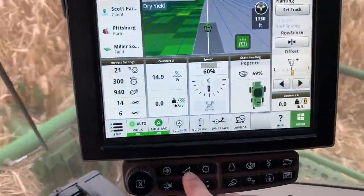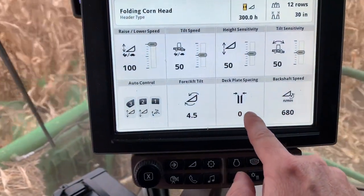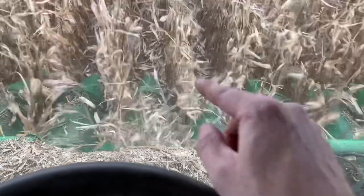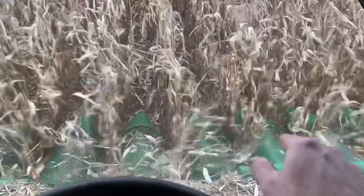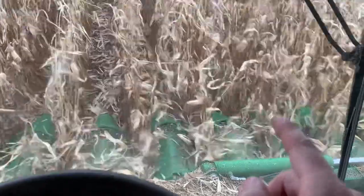The other main thing is the deck plates on the corn head. I have those set to zero — that's their tightest setting, not all the way closed. Where the corn's going down each row, there are metal plates; one side is hydraulically adjustable, sliding in and out towards each other — that's where the stalk goes through. In regular corn, you open those up as wide as your stalk, so the ear comes down and pops off on the deck plates, and most of the plant goes through the head while mostly just the ears come into the machine. On popcorn you want those set on zero because the ears are skinnier.